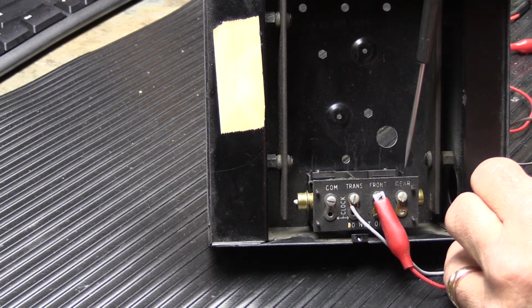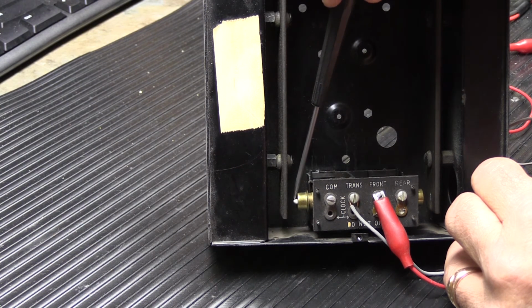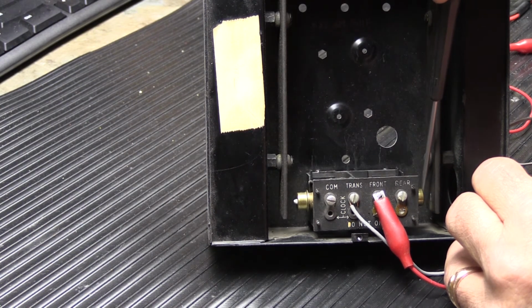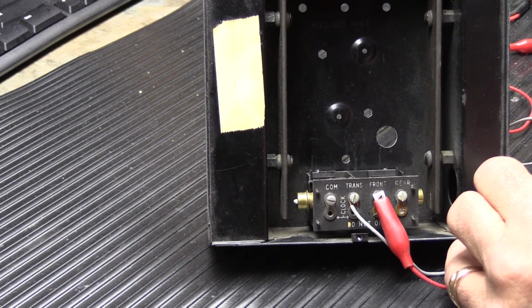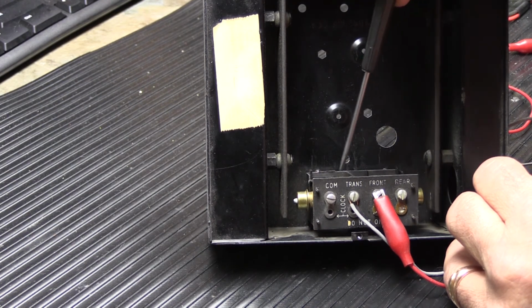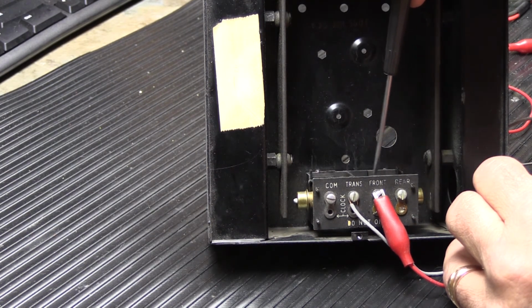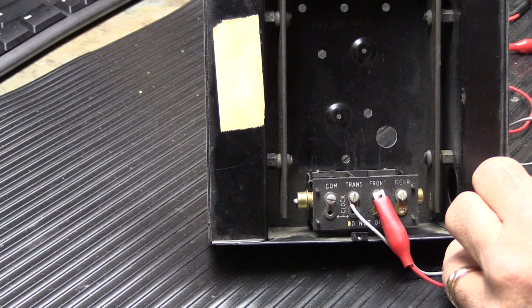If the plunger was sitting all the way here already, if it was sticking out a little bit like this, if it was sticking out on the right just a little bit and the travel of it was only going to be half an inch, it wouldn't have any force. It needs the run up. It needs the space to move to the right to gain enough force to hit the tone bar with any amount of strength. As soon as the visitor, the pizza guy, lets go of the button, the solenoid turns off.